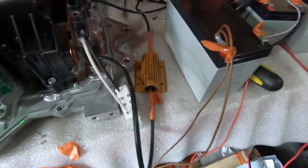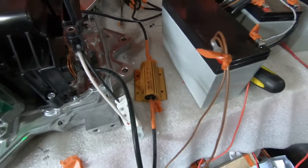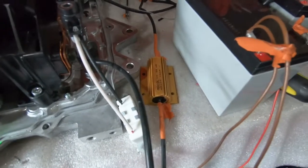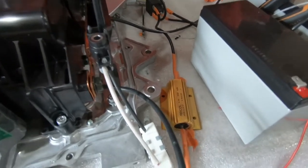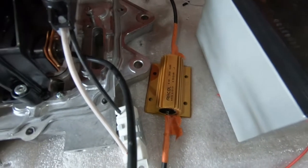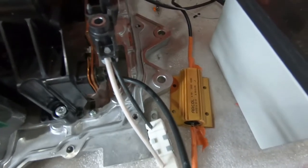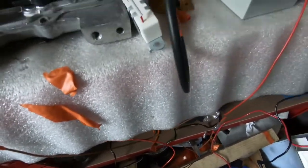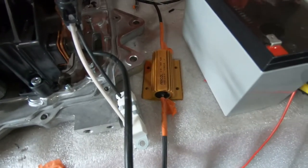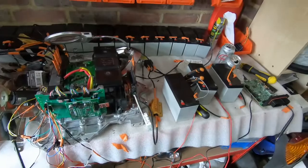A little oversight in moving up the voltages: I've been a bit lazy when testing at low voltage for short periods, and had simply had the power going into the capacitor through the resistor, figuring it was getting there anyway. But of course resistors heat up when power goes through them, and we've managed to melt away all the polystyrene underneath it — which is pretty cool, though hopefully I haven't breathed in any of the fumes. So I'm going to step away from this for a moment, get the proper circuit sorted out, and then get back on with testing.